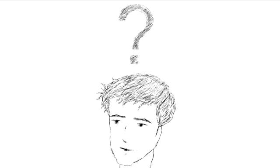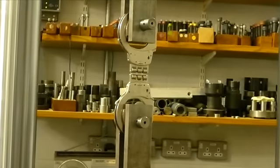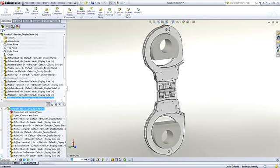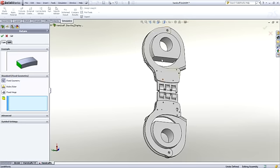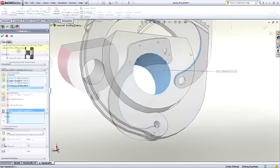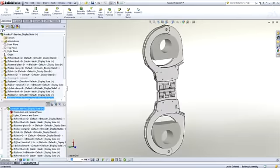Rather than diving straight into the problem, let's use our knowledge of the physical test to guide the simulation. Just as in the physical test, let's include the grips of the testing machine. The beauty of working like this is that the loads and fixtures become very simple, and SOLIDWORKS takes care of the rest. Once we have completed all the loads and restraints, we can hide the grips.